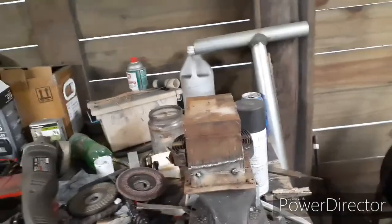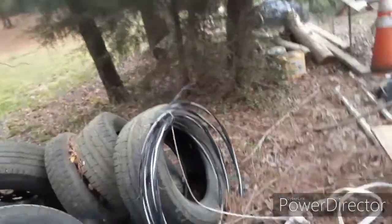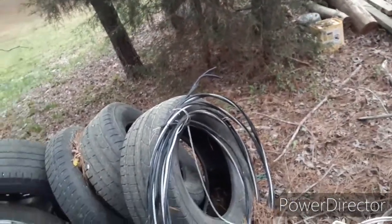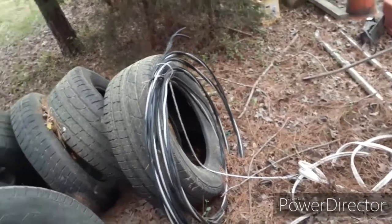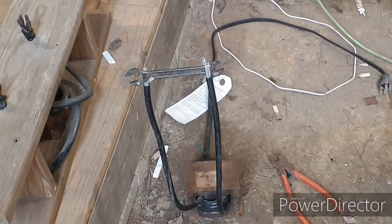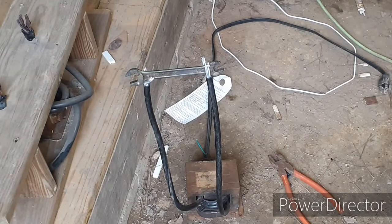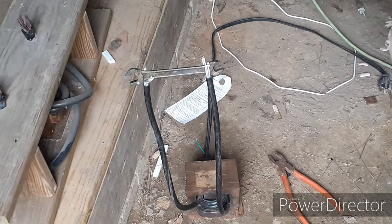So, interesting. All right, we are not done yet. Hold tight. Just hold on a minute. Now, this is service line. This hooks up to a 200-amp service that goes to a house, and it is aluminum. But I'm just wondering just what it'll do. Aluminum is more conductive than steel. I don't know how much more conductive, but I think it's worth a try. All right, this may be a harebrained idea because copper melts at 1,900 degrees or around there. Aluminum, on the other hand, melts at about 1,100 to 1,200 degrees. So I'm not sure how hot that steel is going to get. We're going to see what happens. Let's go for it. It wouldn't be fun if I knew exactly what was going to happen, huh?